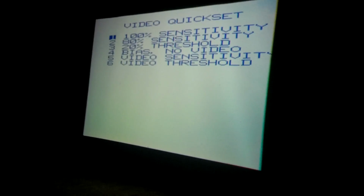Okay, so now I go to the menu again. This time I pick option 2. And now I am interested in the color coordinates that the meter gives off. And now what I do is I'm targeting 0.313 for the middle number, which is red, and 0.328 on the last number, which is green.